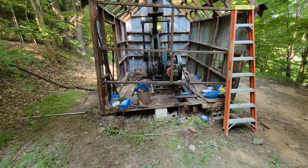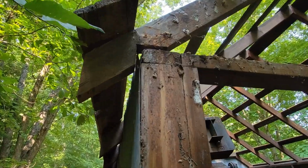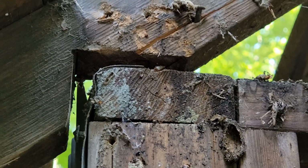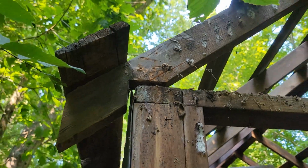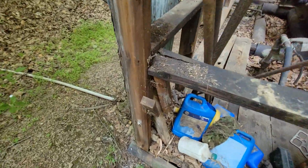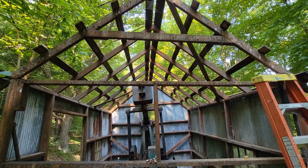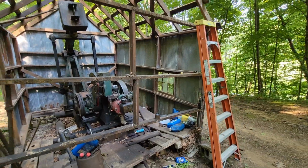And then over here, like I mentioned, the pieces are curled under. You can kind of see right there, that's a side piece of tin. It's laying underneath that rafter. Kind of makes it tricky to come out with the rafter sitting on it, but it wasn't too bad. The rafter's in pretty good shape. I'll probably be able to save them, but some of this is coming apart. Not a big deal. This building was only built in the 50s, and this is your standard 2x4s. Won't be a big deal to replace that and get it to match.